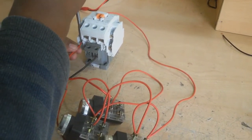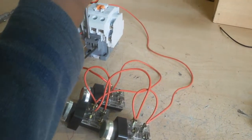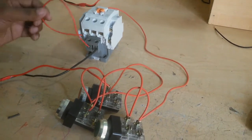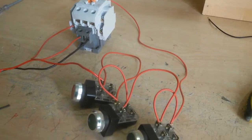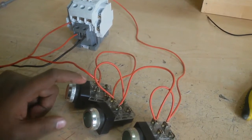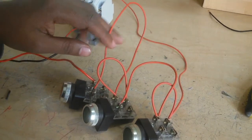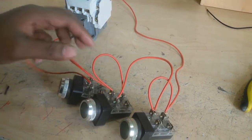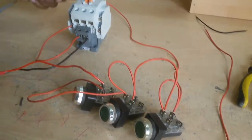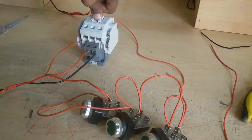It is a simple work, an easy work. You can make it very easily. This is the line you see. First, I connect the phase wire to the stop NC, and due to it being NC, this wire connects here. This line connects to here, and it is an NC, so this line passes here, and this line connects here. All this line passes here. When this contactor is pushed, this NO converts to NC, so the magnetic contactor turns on.